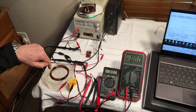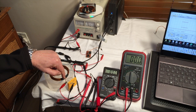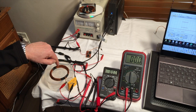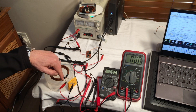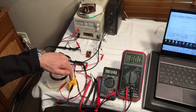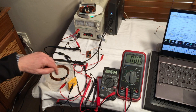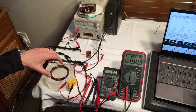So this is, as before, the transmitting antenna. This consists of 25 turns of enameled copper wire with a center tap, and 25 turns of enameled copper wire again, and that has a center tap with what is known as a flyback oscillator that I've created over here. The flyback oscillator is going to create an alternating current in our transmitting antenna.